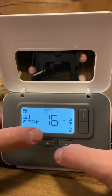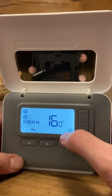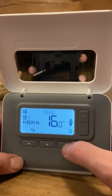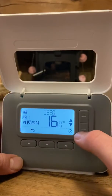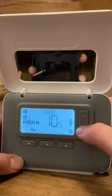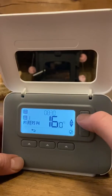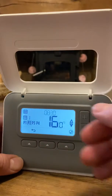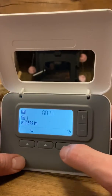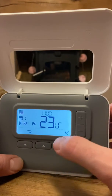Program two is when the heating goes off. Tick to confirm you want to program it, then set the time — say 8:30 a.m. Tick yes. It then asks what temperature you don't want it to drop below. You can turn it right down to 10 degrees, but normally people leave it around 15 or 16 degrees, because you don't really want your house to drop below that. It will still fire the boiler occasionally to keep a comfortable temperature. Tick to save.